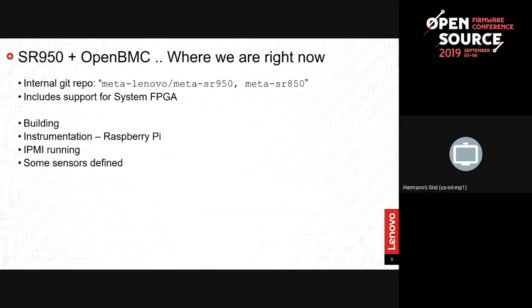We were able to build the code. There was some discussion about dealing with SPI ROM emulators in the lab. We've gone a different route using a Raspberry Pi with flash ROM tooling from the Chromium project, allowing us to read and flash ROM contents from the command line. We can stick the Raspberry Pi on the server, put it in a rack, and SSH in to have our way with the SPI ROM without any physical access to the server. This lets us recover and analyze in cases where we corrupt our SPI ROM, which happened quite a bit going from a 4-megabyte ROM to 32-megabyte — we had some issues with address translation.